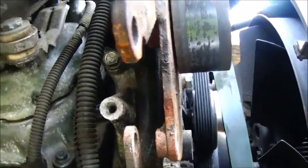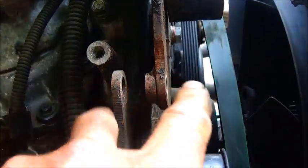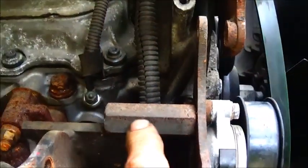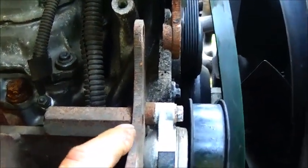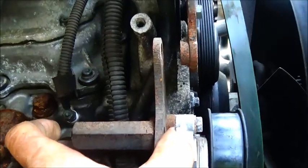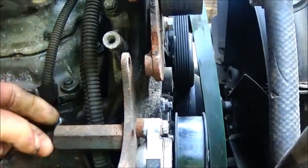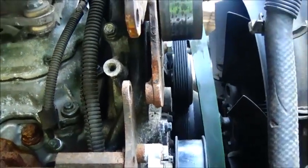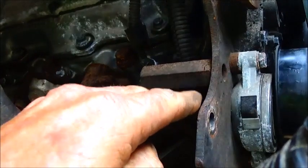We're gonna start by tying these two mounts together with a bolt and a spacer in between. I'll measure it out and cut a spacer. For some reason they've got this welded on there — there may be threads in it. This should be tied to this; it's welded here but not tied in here, so if we have to, we can take a long bolt and run through the whole thing. From the looks of it, it's three-quarter here, so it should probably be a half-inch coarse thread.